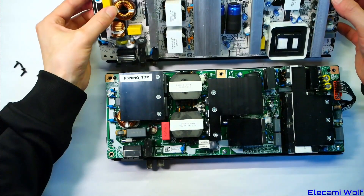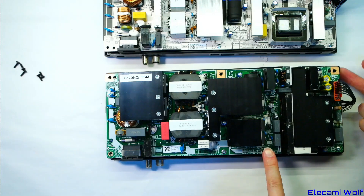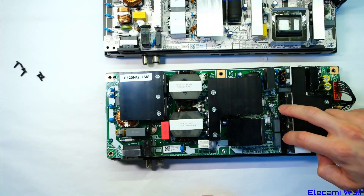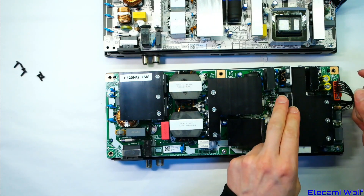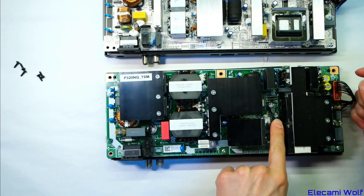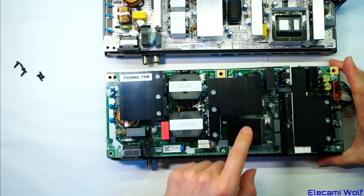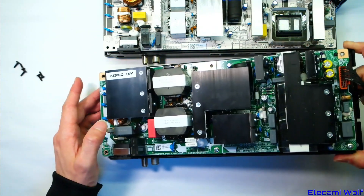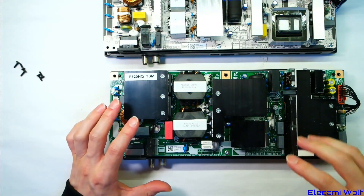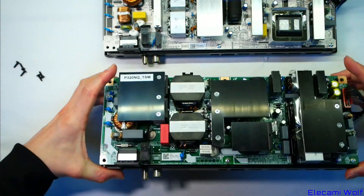That's more than this one can take. The PFC chokes are way bigger, and there are big TO247 FETs — not the TO220s. And then there are two transformers. I guess they're running them in parallel or series rather than interleaved. Might be an LLC-type thing. There are capacitors there, and the auxiliary section again. It still has some blank positions for more parts. I guess because they have an 80-inch or 85-inch in this range — this is the 65-inch, but there may be a 75 or 85-inch available.